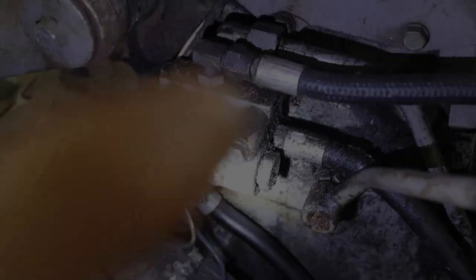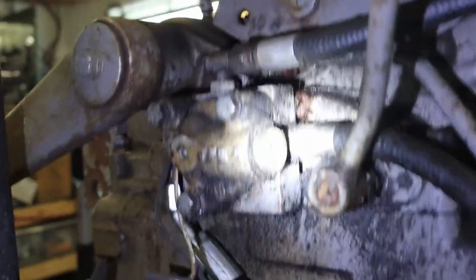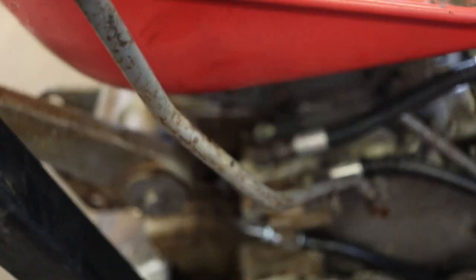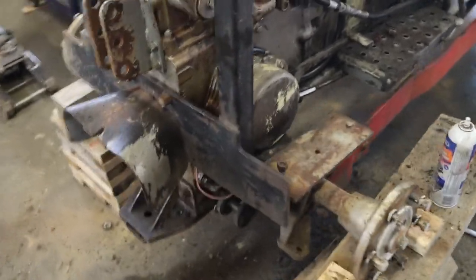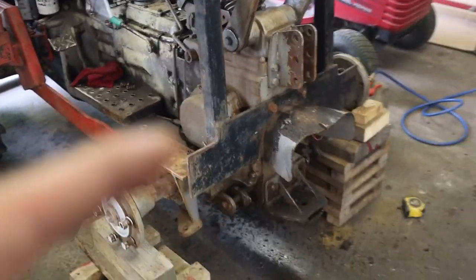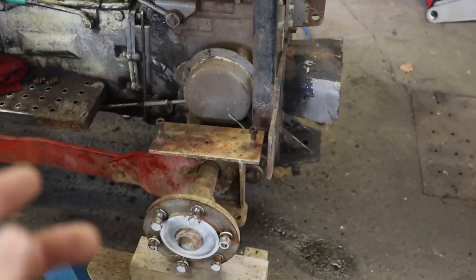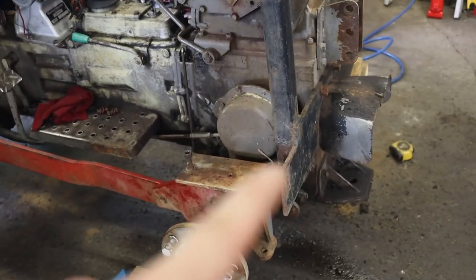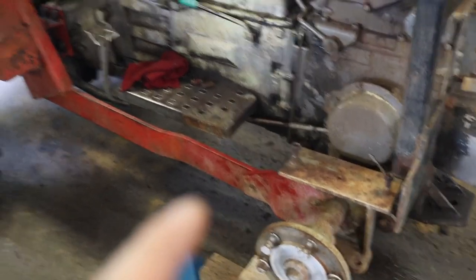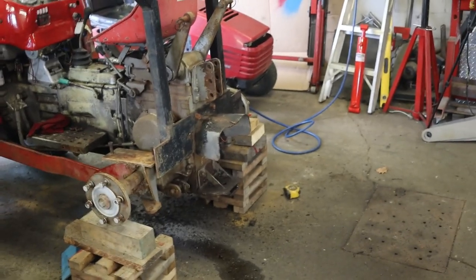With the fender out of the way, I found one of the many hydraulic leaks on this tractor. I cleaned up that section and it was only that rear fitting that was a little bit loose — now it's properly torqued. The next step will be to figure out how to attach the base to the tractor. Luckily I have a starting point — that black plate which the previous owner installed himself. The next thing will be to extend that down and add stiffeners, connecting the rear end with that flange and also attaching it to the front loader, so the rear and the front become kind of a solid piece.